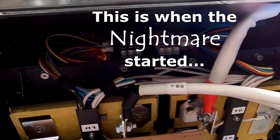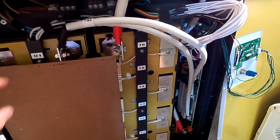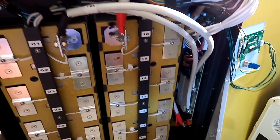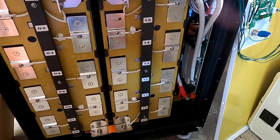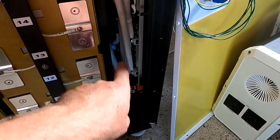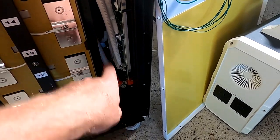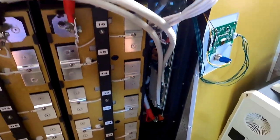Now in the second step, you want to install the switch to turn on and turn off our active balancer up here. And we have to somehow disable our battery first for safety reasons, of course. Let's do a bit of a risk analysis here. We've got the positive down there and the negative is far in the box, so unreachable. So we cannot actually disconnect the cables there. Positive would be possible, but I want to disconnect both.